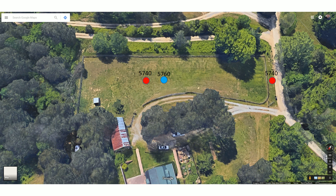When I did this initially, nothing changed on the 5740 link. But then I walked closer and closer with the 5760 copter. The closer I got, eventually it would be right on top of the receivers, screaming in their ear, overpowering the 5740 signal from the weak, faraway copter. I looked to find how close I could get to the receivers before I started to see interference, and specifically which receiver had interference first.